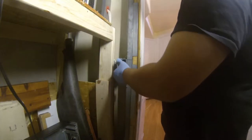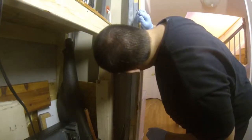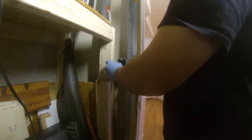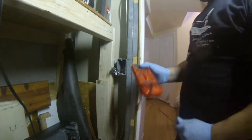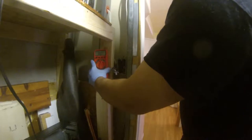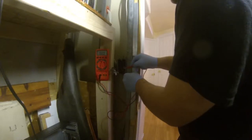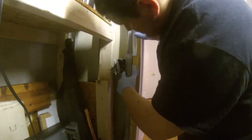This is a single switch outlet — you'll see it's got a safety ground here and then we've got the hot running through. The first thing we have to do is figure out which side the light is on, so we remove the switch and use the voltmeter. At 200 volts AC range: this wire reads 120 volts — that's the incoming power hot. I'm also going to need to get the neutral wires out — the white wires here.